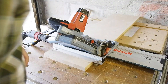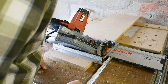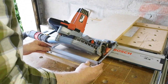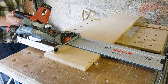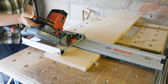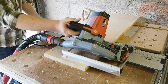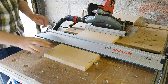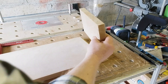In case you're wondering how close you can have the fence and spacer to the saw on a 45°: on this saw it's about 45mm from the inside of the spacer to the rail and about 83mm to the back. As I can, I'm moving the fence out a little, giving a nice wide footprint. When you start you have to take a little of the weight of the saw so it's flat, but as you can see it's an easy one-handed job with the fence for support. Those marks on the MDF under the fence appeared to be residue from machining — it came from the grub screw holes.